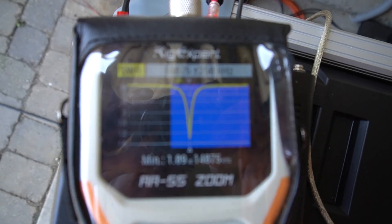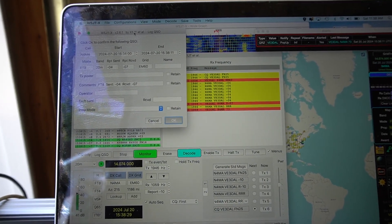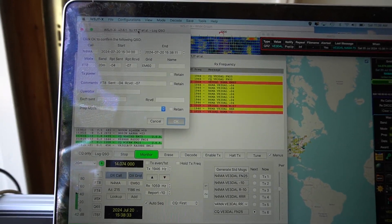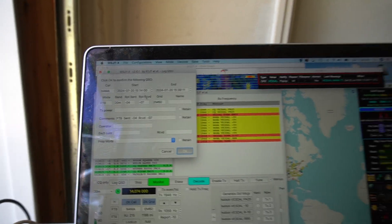Let's see if we can do some contact. Finally came back with the report — I was minus 0.7. That's not bad. But you see how long it takes to slope around, probably because of the signals I get around here. But it's all good. Overall I'm pretty happy with this antenna. One thing I forgot to mention is that I added a 1:1 balun at the coupling loop, because somebody suggested I do that to see if I would get better reception and transmission. I think it did help a little bit. I used a little 1:1 balun with a max of 100 watts, though I never transmit 100 watts — right now I'm transmitting 20 watts.